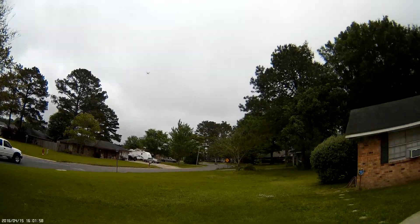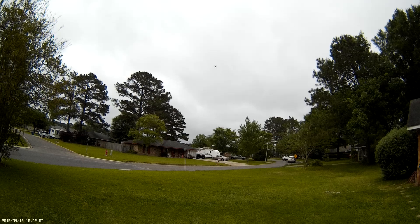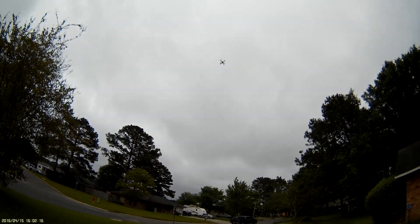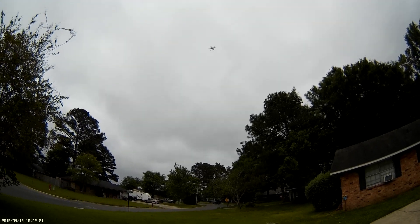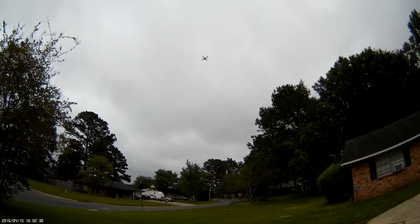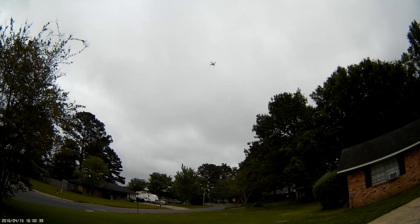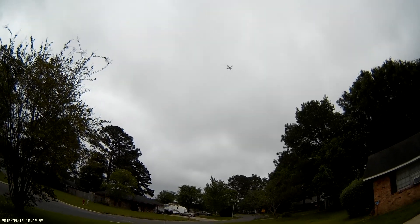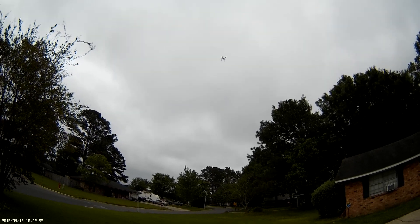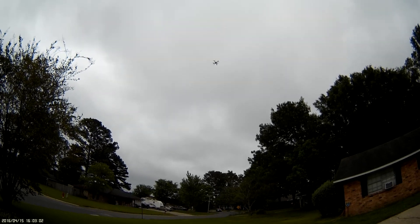It hunts and then stops, and we still do have a good bit of wind out there. You can see the copter adjusting itself. Position hold and loiter are going to get a lot better when we add weight to it — right now it's bare. When we add a camera and gimbal, it's really going to anchor the quad in the air and you'll get a much more steady hold. I'd be upset with this hold in wind with a camera, but the gimbal will hold it down. Also, I'm running carbon fiber props — with the wind buffeting it and no flex on the props, you're going to see it in the movement of the body.